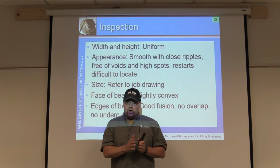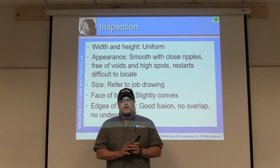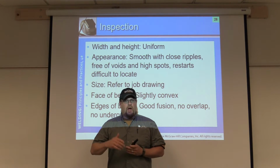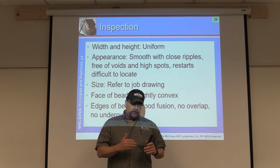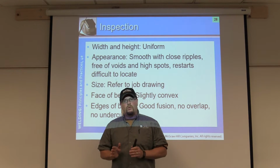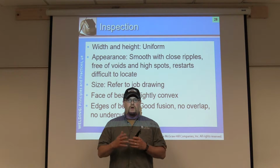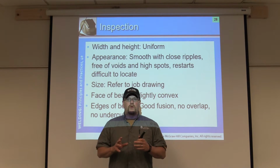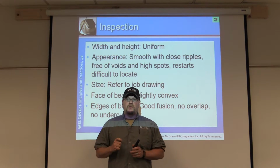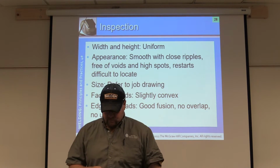If you are welding along and all of a sudden something goes haywire, okay, and you don't understand what happened, don't continue welding. Stop right there. Come back in if you need to. You can grind it out and fix it. We need to start that habit right away. As soon as something starts going haywire or kind of acting goofy, we need to stop welding, fix the problem right there, then pick it up and continue on, creating a good, solid quality weld. Okay?